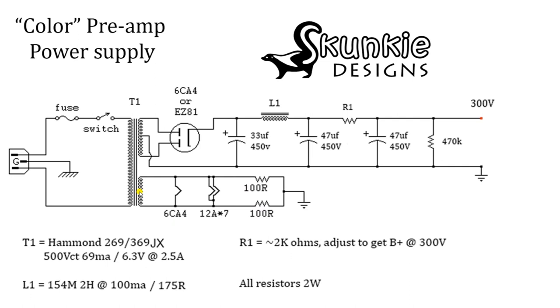The transformer I used had a center tap on the 6.3-volt winding that we could just ground. This Hammond does not have a center tap — no worries. Just get a couple of 100-ohm resistors and you create a virtual center tap that we connect to ground. In an earlier video I talked about possibly needing to raise this above zero potential because of the cathode-to-heater voltage issue — it's not really an issue. When I read the data sheet more clearly, 200 volts is what the heater to cathode can be. So not an issue at all that we've got almost 100 volts on the cathode of one of those tubes and this is just grounded. The amp is totally silent with these AC heaters with the center tap grounded, so just ground the center tap.